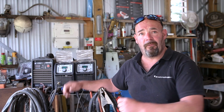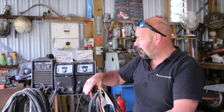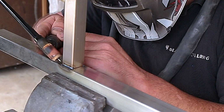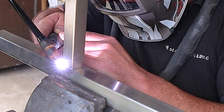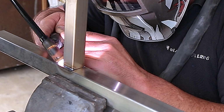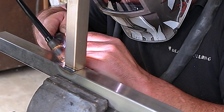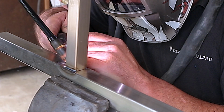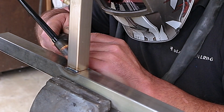We've had a couple of big stainless jobs in, and you can actually get 2 people burning away, and it's really good. They're both beautiful machines, and like I say about the DC machine, just the stability, the ease of working, they're bloody top notch. Probably the lowest I've run would be probably 12 amps on the DC machine. Make sure you've got a good helmet as well, because at that low amperage you get your flicking, but even right down on that low amperage, small tungsten, they're really stable, and I cannot complain about these machines at all.